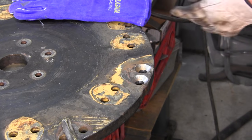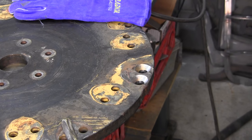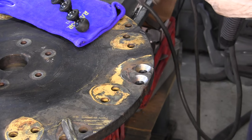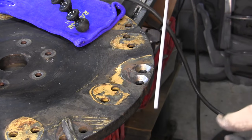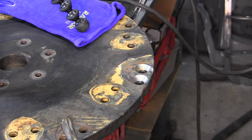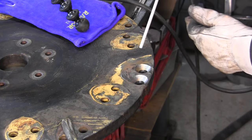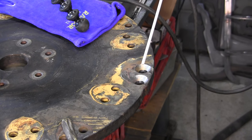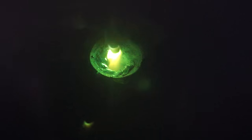That fitting bleeds a little bit so I leave it unplugged until I'm ready to use it. Let me get the camera set up and we're going to start filling in these two holes. I've got a good ground already on there, and I've got my stinger lead draped over the table so there's only about two feet of it free. That way when I'm holding my stinger it feels light like a pencil and I've got pretty good control. I steady it with my left hand a lot when I want to precisely place the arc.